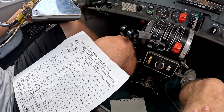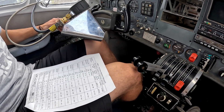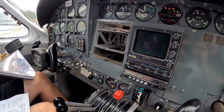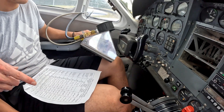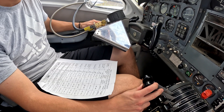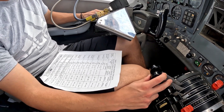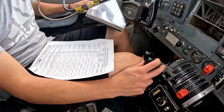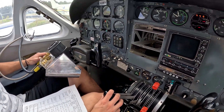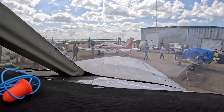The assumption is that over the course of the output for the pressure pump, that metered psi range is going to be good for every other range that the engine demand requires. If you move your throttle control just a little bit, you'll be at maybe 1500 to 2000 RPM, and your metered pressure will probably be somewhere around 13 or 14 psi. But as the mechanic, we just want to know that it's making max fuel at max power. So let's bring it back as far as we can, Jason. We'll call this idle. We're at about 600.